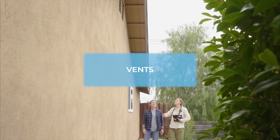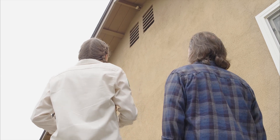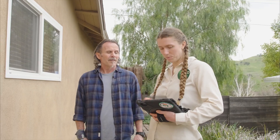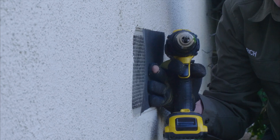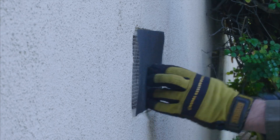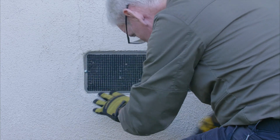The eaves look pretty good but I'm seeing an attic vent right here. I can see it has quarter-inch screening on the inside, which keeps the rodents out but embers are still able to get in. So it's recommended to go to a smaller size screening — 1/16th or 1/8th inch will keep more embers out and help protect your house. Another option is to hire someone to do a fire-safe vent. If you decide to install screens yourself, keep in mind that a finer mesh screening will also reduce airflow, so we recommend using an online airflow calculator to select the appropriate screen sizes for your household.